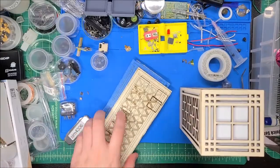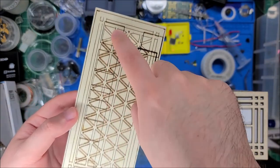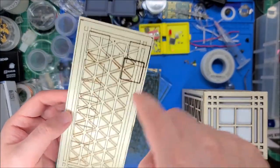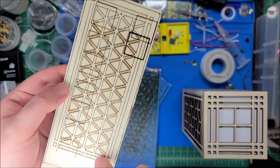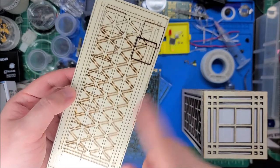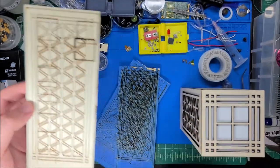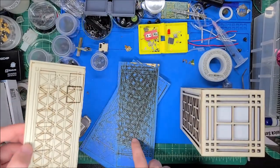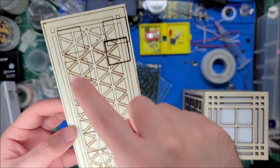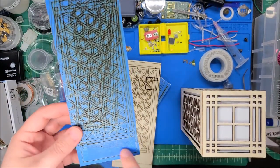I was off doing something else and not keeping an eye on it — that's a bad thing to do. I also reused boards to test how many passes and what speed to set. You can see on one it skipped a step because I drove it too fast and it lost a step. I learned to put blue painter's tape on because there's charring outside of cuts — blue painter's tape helped immensely, and you just peel it off after; the laser cuts right through it.